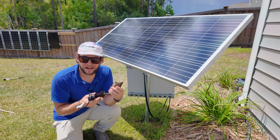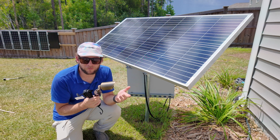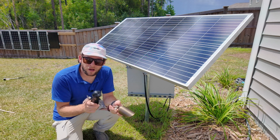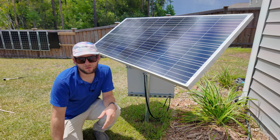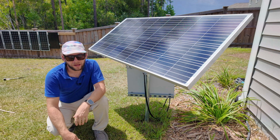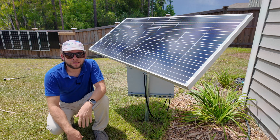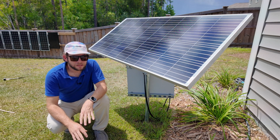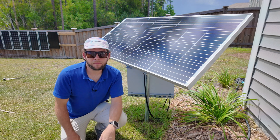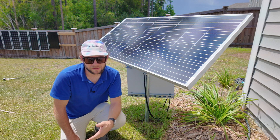This is a brass fixture, it's going to last a really long time, the bulbs are replaceable, and you can put LED bulbs in here which is kind of a must. But you're not getting away from the wire. A lot of people choose solar landscape lights because they want something that just sticks in the ground and they move on. But that's never really going to be the case, primarily because the ideal place for a landscape light is 90% of the time going to be the worst place for a solar panel to gather light.